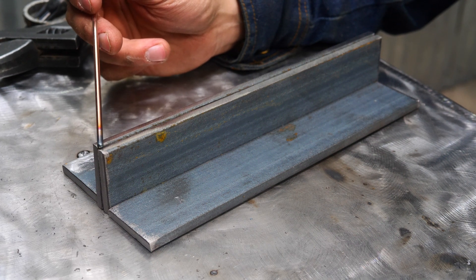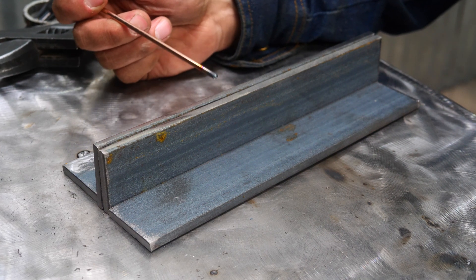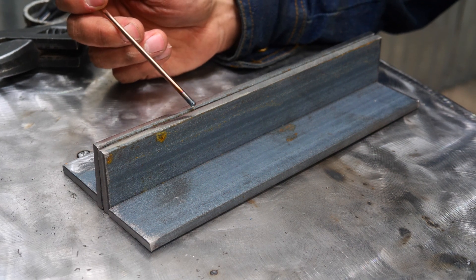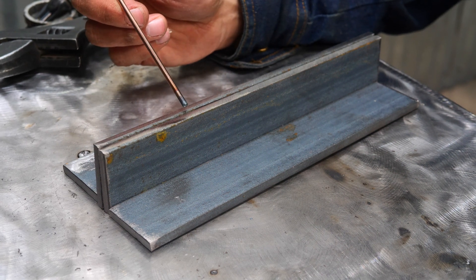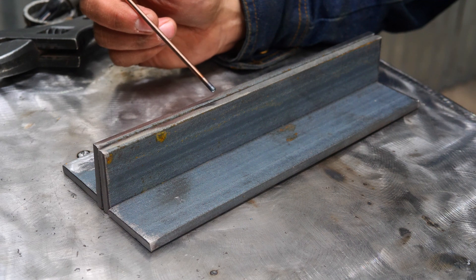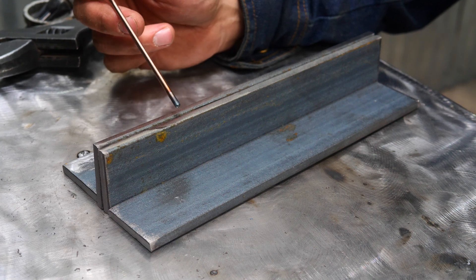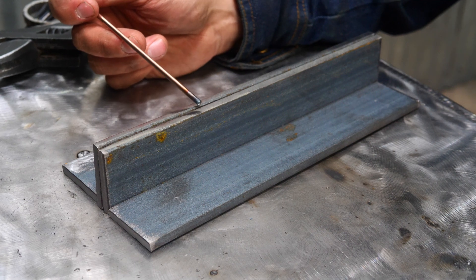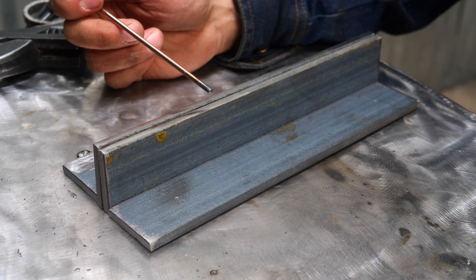Here's the outside square edge corner joint, and where I see a lot of problems is when the welder makes a nice weld across it with sufficient throat — coming off the plate about an eighth of an inch — and combined with the arc penetration into the parent material, that gives us our throat. We're looking for about a 3/16 inch throat here. But then the welder takes a flap disc and grinds all that reinforcement down to blend the corner. It's okay to do that, but not okay to remove too much. We're going to make a weld, grind too much out, and see how strong it is.